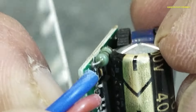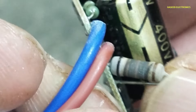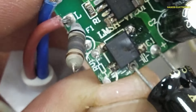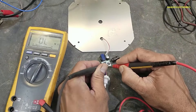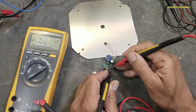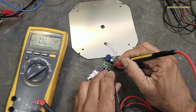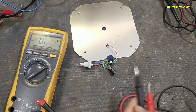If you see this capacitor, its top surface is swollen upside, and this resistor is heated up. The bridge rectifier is also damaged. This resistor is open circuit. Checking the diode and positive terminal of the capacitor — yes, this bridge rectifier is short circuit. This is due to this capacitor.